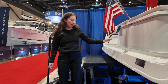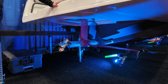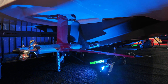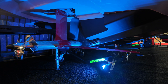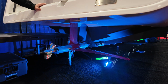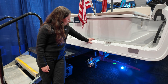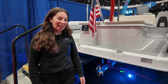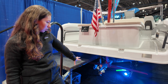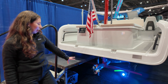This here is our aft foil system and the C-Pod. The C-Pod is our dual electric motor with contra-rotating props that we created in-house. It's kind of the first motor of its type. There's no oil, no coolant, nothing like that that you're going to have to change from a maintenance perspective. And that's the whole thing that's getting you out of the water — this is our only propulsion system on the boat, but it's really all that you need to keep you flying.